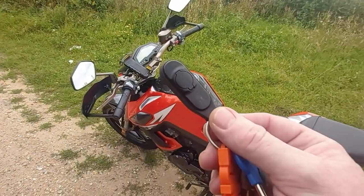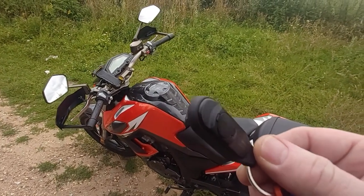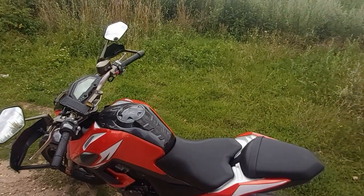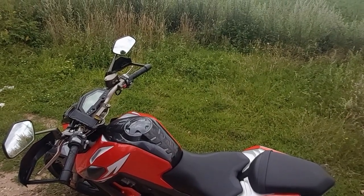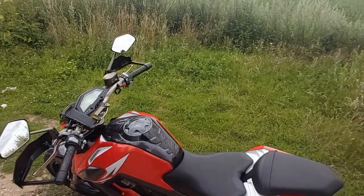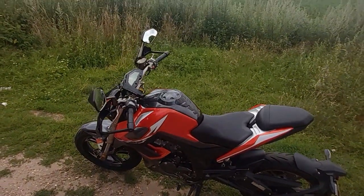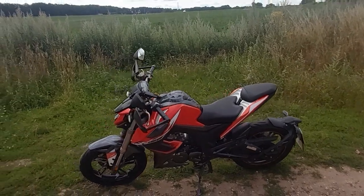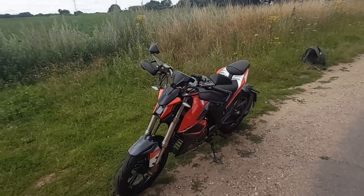What these have inside them is a Panasonic BR-1225 battery — they cost about six quid each, available on Amazon. There is also the CR-1225. Even though they are both exactly the same size and both lithium, they are not the same battery — they have different chemistry. The BR lasts longer at a lower voltage. Even though both say three volts, the BR has 48 milliamp hours and the CR doesn't. They're designed to work in different ways.